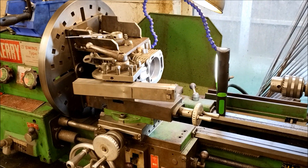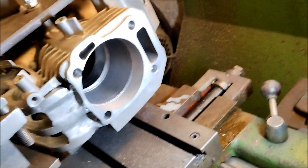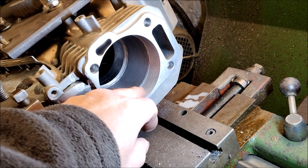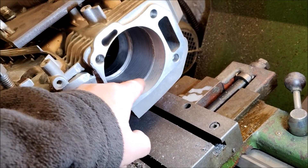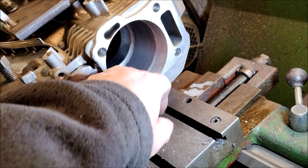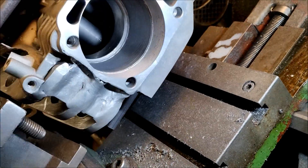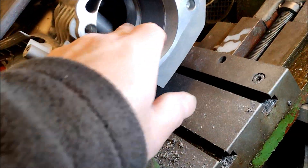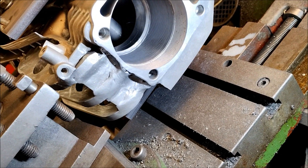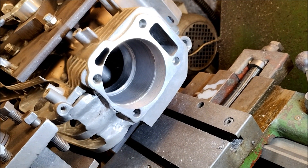Okay, this is the last part of the video — not good news, but I'll go through why. I've cut through the sleeve in three stages, and the sleeve has just fallen out at that point. I'm still cutting and you can see there the thickness of the sleeve. This sleeve has a five millimetre wall. So that's where I am at the moment.